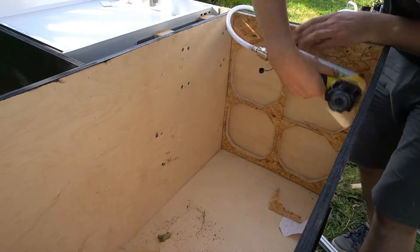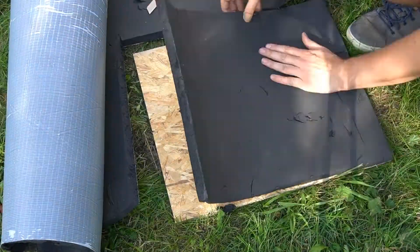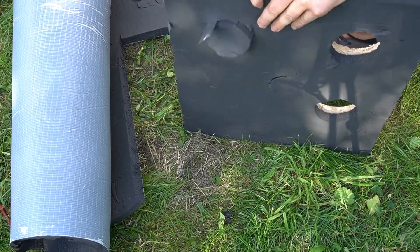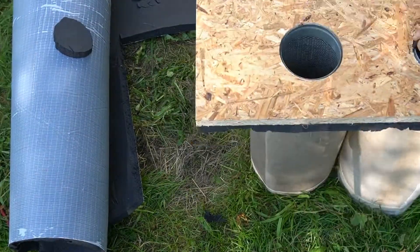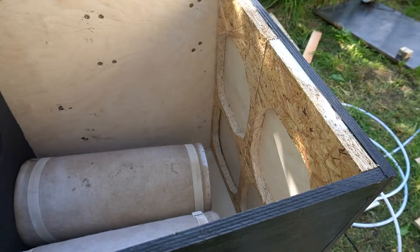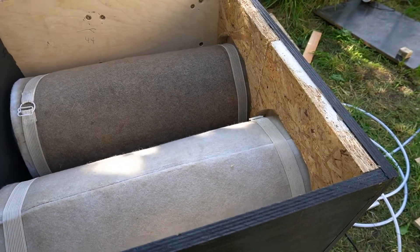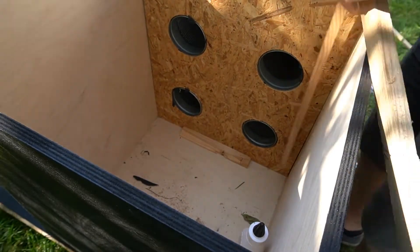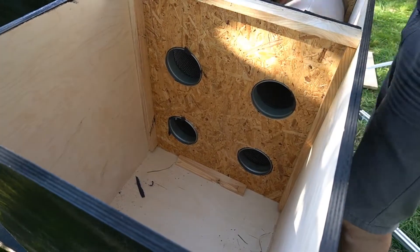To mount them, I came up with this quick and easy solution. They are basically clamped together by two sheets of wood. And to seal them up, I applied a sheet of self-adhesive foam called Armaflex. After the foam was applied to the wood, I cut it to size and also cut some holes into it, so I could push the filters through these holes and they were nice and tight. One side sticks through the hole in the sealed plate and the other end is then just laid into this holder plate. Then to fix it in place, I just used the nail gun again with a couple of nails and these little strips.